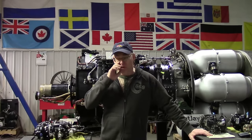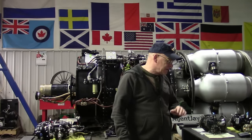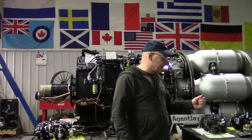I was inspired to give this explanation because Blanco Lirio talks about the different pumps, tanks and boost pumps in his video, but like a lot of people very familiar with a certain industry or technology, sometimes the littlest details can be confusing to someone who doesn't know them. I wanted to help by explaining what a boost pump is and how it's different — it's just a soft little supply to the fuel pump to make its job easier and to make sure the fuel pump never starves for fuel.